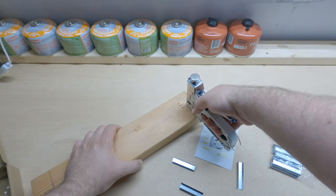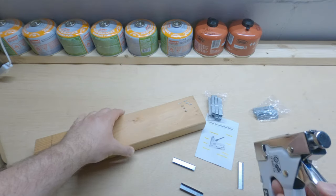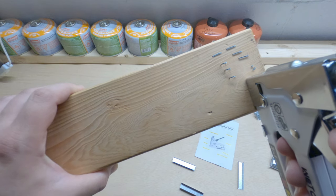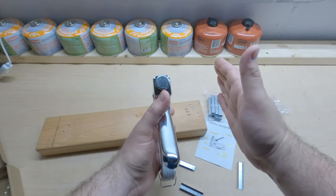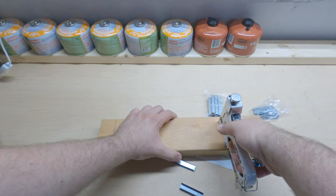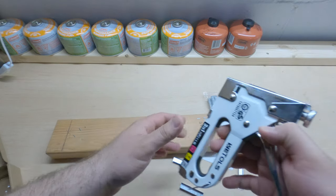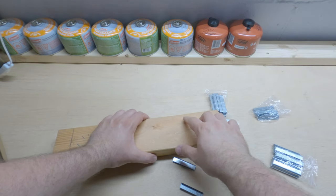Let's try it again — that one went a little further. Let's try a little more pressure, about three turns. It does staple on the right side only, so if you're stapling material in a line you have to make sure you're stapling correctly — it's on this side only, not in the center of the gun. It's still sticking up a little bit. Let's try turning it down just a little bit more, give it about two or three more turns.